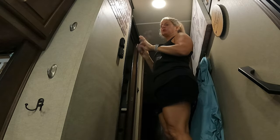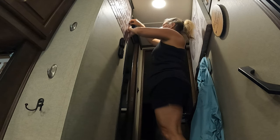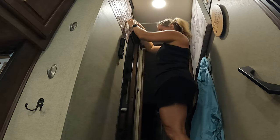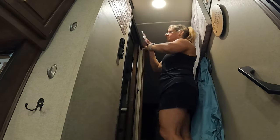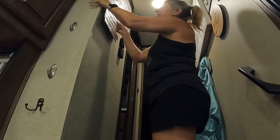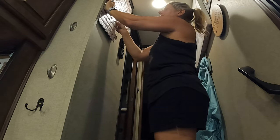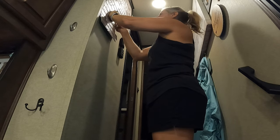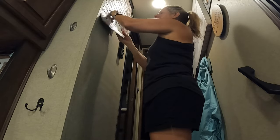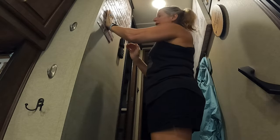Every time you cut a piece of tile, you're going to want to dry fit it — make sure it fits before you stick it up. Like right here, I need to trim just a little bit off this corner. Also, you want this to butt up against the piece; you do not want them to overlap. They seem so much better when you butt them up. I accidentally overlapped a little bit up there, and you can definitely tell where I overlapped it.